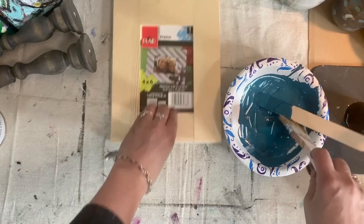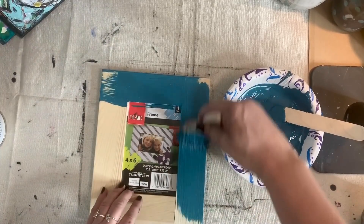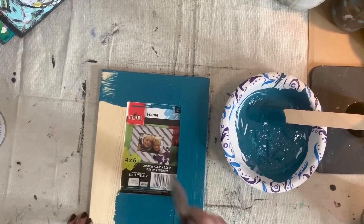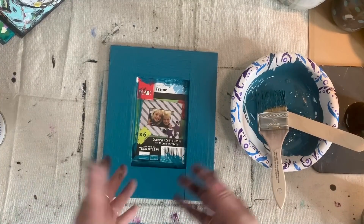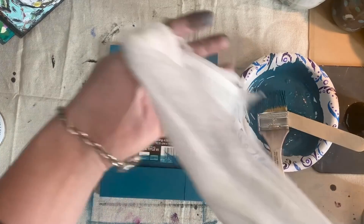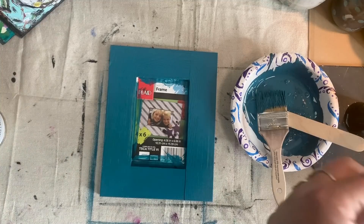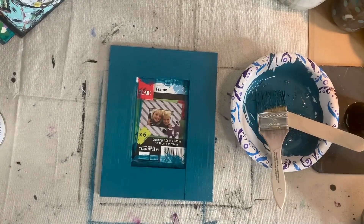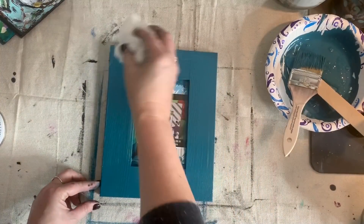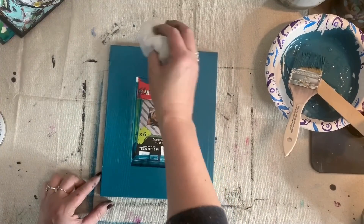Let me grab a brush, go bananas. Pull down our frame — same idea, this is my glaze. I'm going to go right over the top. Go with the wood grain. Get the little inside edge. I've got my Seahorse glaze on — in this case it's on raw wood. I'm going to use it like a stain. I'm going to grab my cheesecloth, about a snowball in my hands. I'm going to open up my cheesecloth, try to get it away from my project so I'm not having any lint fall on it. A couple spritzes to get it damp, not soaking wet. And then start your swipe off — the longer I leave it sit, the more deeper of a blue glaze I'm going to have staying behind. And now we start to wipe.